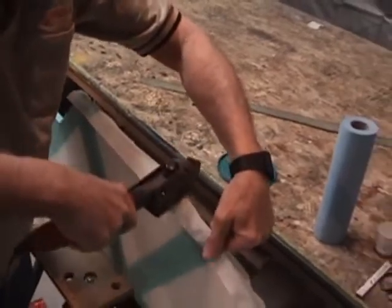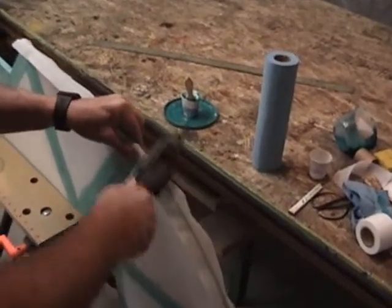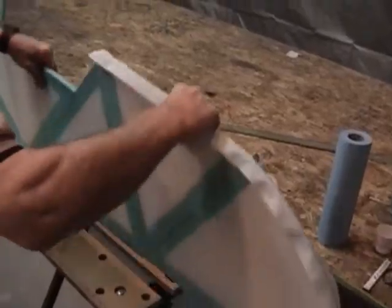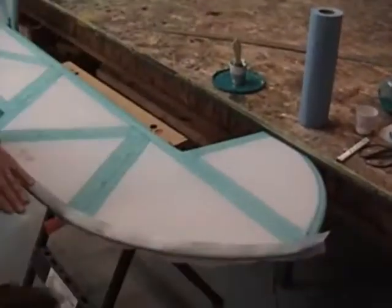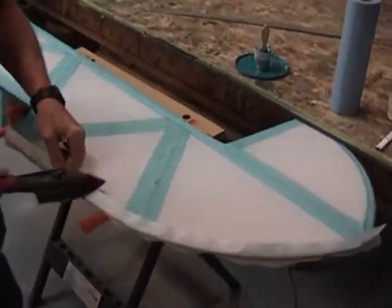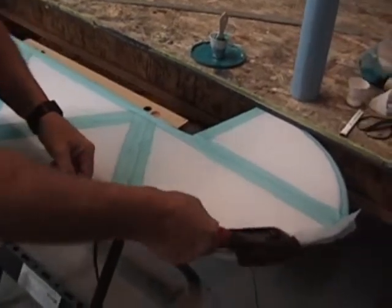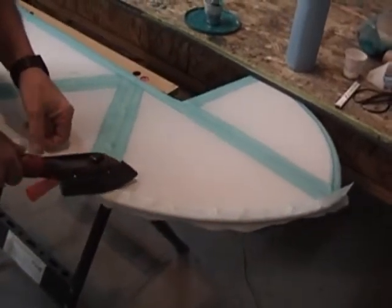We're going to just heat this perimeter. You can see a little bit of a glue line forming there — when you see that, you know you've got a pretty good heat-bonded area. What we'll do is lay this panel down and form this tape so it goes all the way around this edge. To do that, we're going to use just a little bit of heat on it. We're only going to use what heat it takes to get it to shrink. You can start on the outer edge of the tape — you can see it pucker and wrinkle, and that's really kind of a good thing.